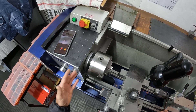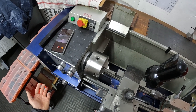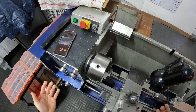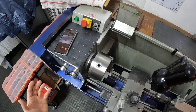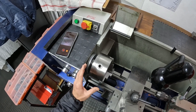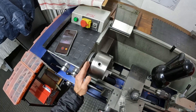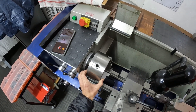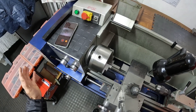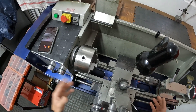What some guys do is they take the taper inside the spindle, put a DTI on the inside of the taper and say it's 20 micron out or 10 micron out. But that might be within spec. And if you handle the chuck and move it around, you are going to get some movement on your DTI — fundamentally because this is an assembly. I have a very accurate old German milling machine, a horizontal milling machine with journal bearings, and even that pulls up to only 20 micron accuracy when you apply a force on the spindle. So to get 10–20 micron accuracy on a lathe spindle with taper roller bearings is actually pretty good. So all these YouTubers measuring stuff and looking at the DTI moving — rubbish.